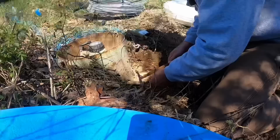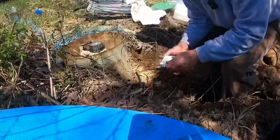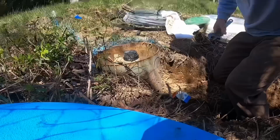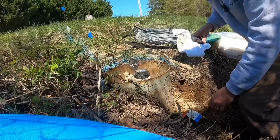Get the burrs knocked off this copper pipe, and then we'll be able to slide that shark bite ball valve on there. That's good and smooth. I'm gonna go ahead and put this shutoff valve on there, and I'm gonna test that very first thing, see if that's gonna leak. Let's find out if I get a bath or it's gonna work. Voila, no leak. Good, first fitting works.